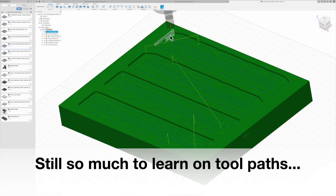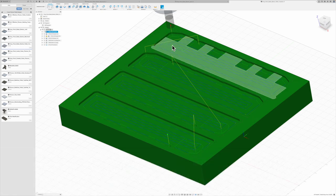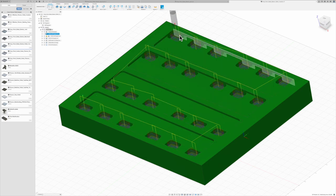On this half inch cutter, it's almost a little aggressive as it plunges down into the aluminum, but it's aluminum. I think we're gonna get away with it. It's gonna be fine. We're gonna get rid of that material. Then we're gonna go to our 3/8 cutter, and pretty similar how I roughed these out. Again, it's not plunging down. That half inch cutter doesn't take out the very corner and it leaves some little steps on the side. So I do need to make sure I start at the top.